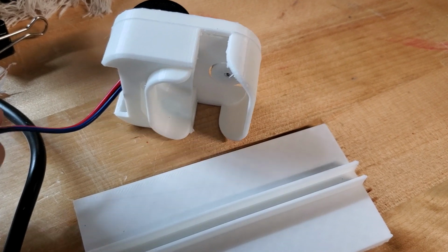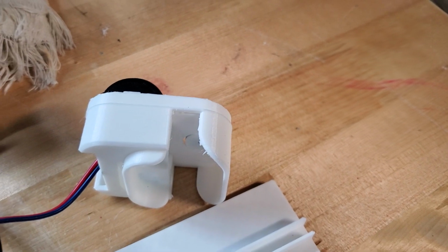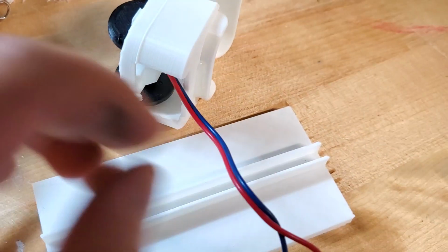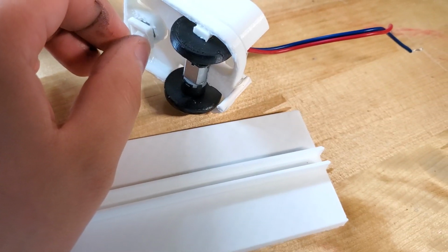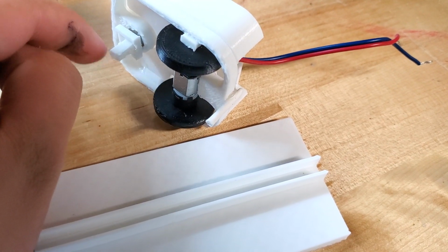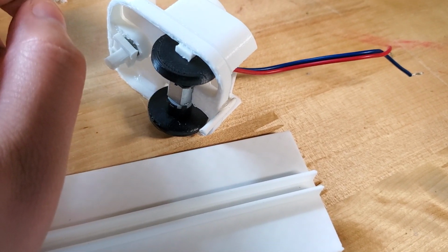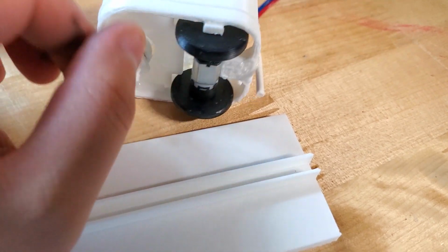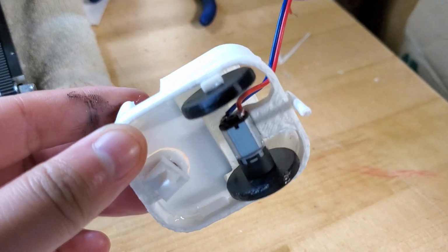And I can also have it phase through really quickly, so high, high, low, high, low, high, low, in between. Pulse width modulation. I'm not sure if you know what that means, but you can look it up. It's pretty simple. It just means you fluctuate really fast through the high and low voltages, and so it averages out to where you might want. And then you can alter that so it raises or it lowers, and it's a whole thing. But it makes a lot of sense. I guess I'm just complicating things. But yeah. And then was there something else I was gonna mention about it?